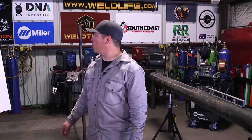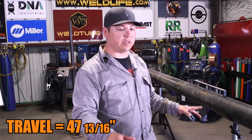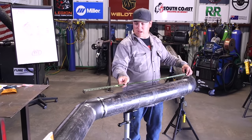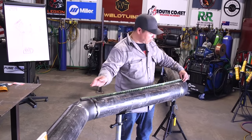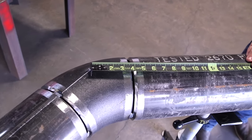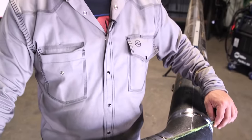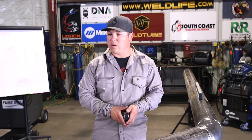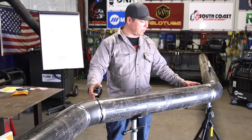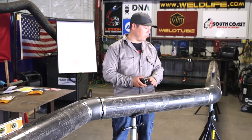We already have our travel, which is 47 and 13/16 of an inch. As you can see, I already have this simple offset laid out here on 6-inch pipe. I'm going to measure center of our 45 to center of our other 45 — that is going to be our travel dimension. So in order to find our actual pipe cut length, we still need to do our takeoffs for the 45s.